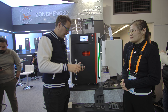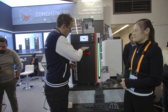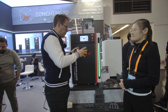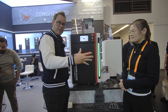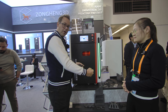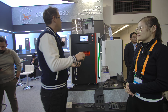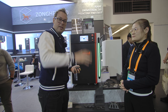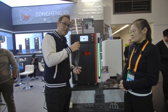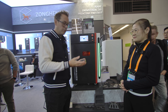This prints with absolutely no supports. For anyone not familiar with SLS: there is a cartridge that sits inside full of powder, a brush spreads powder over each layer, and a laser then burns it — but the powder stays in place for the whole layer. Once you're done, you remove the whole cartridge and it goes into a reclamation station, which is included in this package, enabling you to remove all the excess powder. Then you're left with a basically almost-finished print.